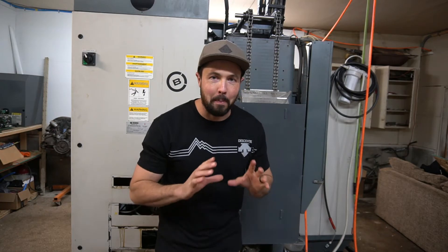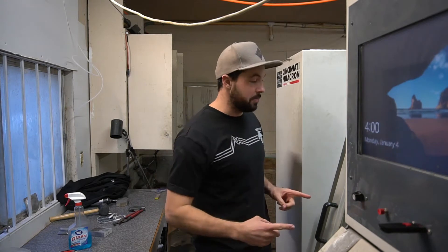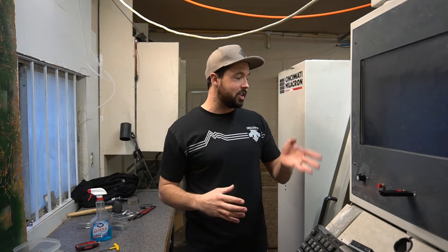We are gonna have so much fun. We're going to be speed testing the feed rate on the Arrow 500. The specs on the Arrow when it was brand new were about 475 inches a minute on the table and Z axis for cutting speed, and about 780 inches a minute on rapids. With the new Centroid Retrofit, I'm gonna try and turn up our feed rates to around 400. I want to start at 100 inches a minute and cut a really basic part, then bump up incrementally — 100, 200, 300, 400 — just so you can see the difference in speed and feed rate.